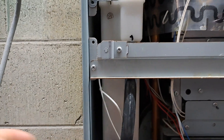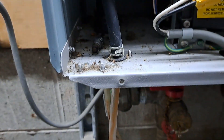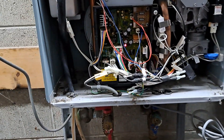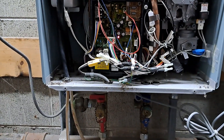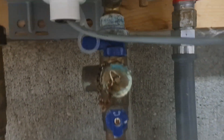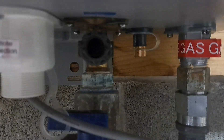Right here — this is the neutralizer. Condensation comes in here, then it drips out down here and goes into the drain. That still didn't work for us either. Our neutralizer was clean and free of obstructions.